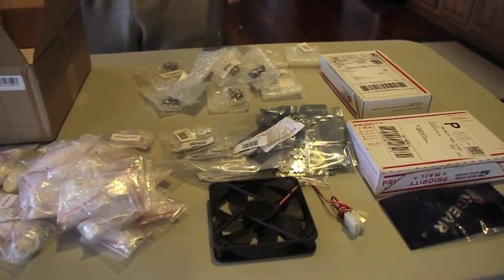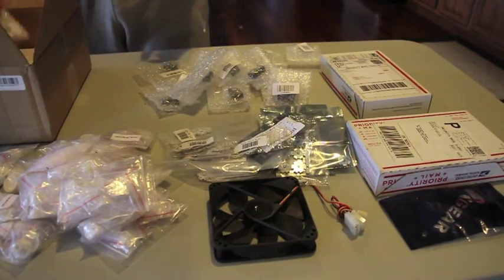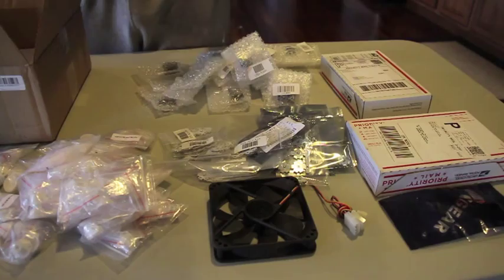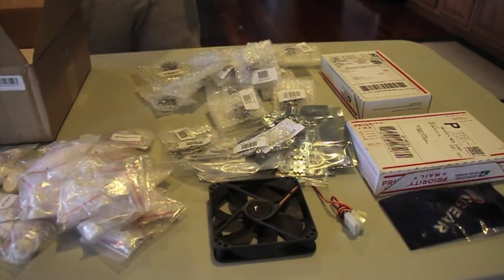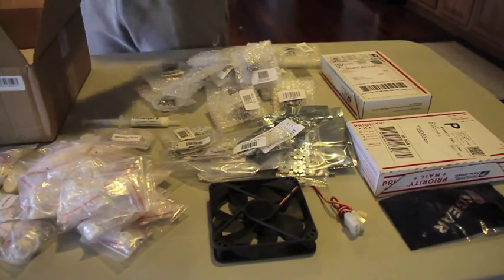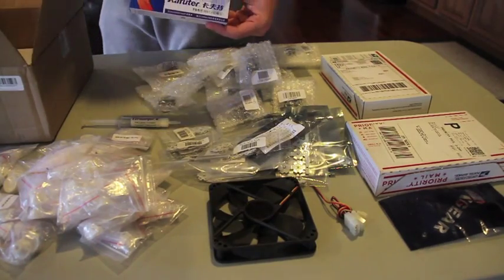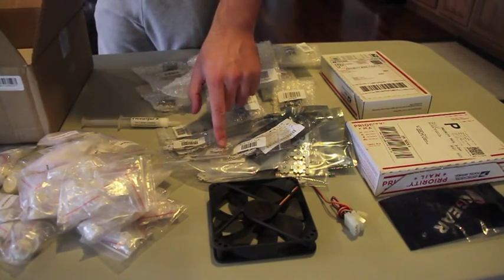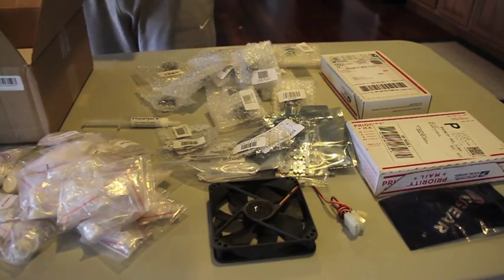They all come individually bubble wrapped. Here's the 500 LDD — that would be for the fuge light — and the rest should be 700. And then we have our thermal grease. And then two boxes of silicone glue that are used to attach the lenses to the LED stars, because other glue like super glue can actually ruin the LED.